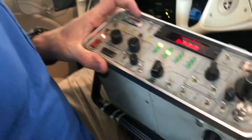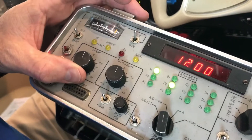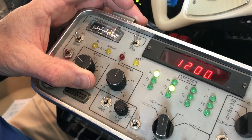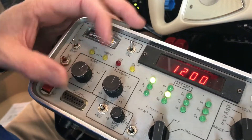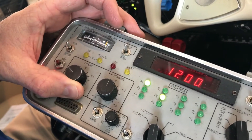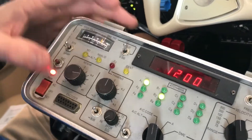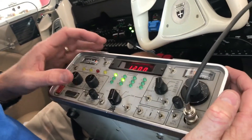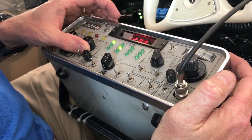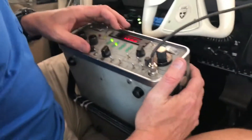What do you mean when you say they have to be the same? See here, see how this is a zero in the middle and it says minus four, plus four. They've got to be close. You don't want to see like here it starts blinking and then here it starts blinking. You want it to be — see right there — it's starting to blink at minus four, minus five; same thing here, plus four, plus five. So the same each way: minus negative and plus positive, same with the framing. If you're getting it where this doesn't do it till way down here but this one does it right here, then something's wrong with the framing or the interrogation of the transponder.